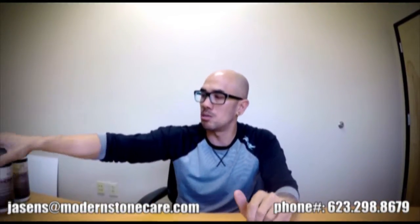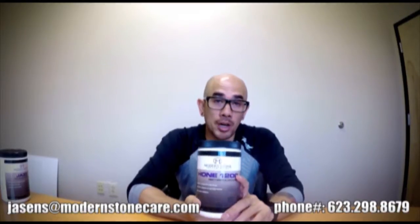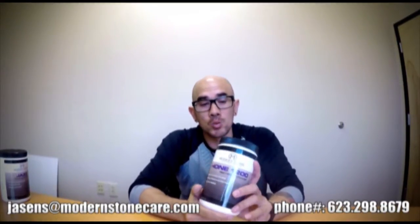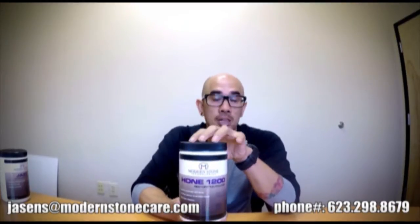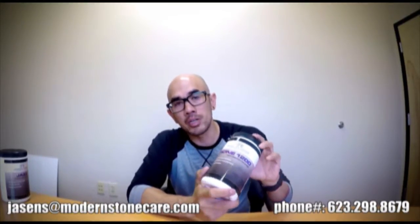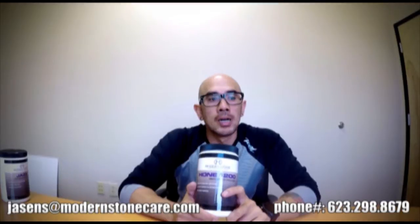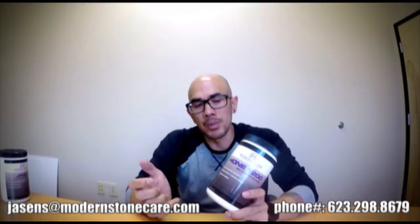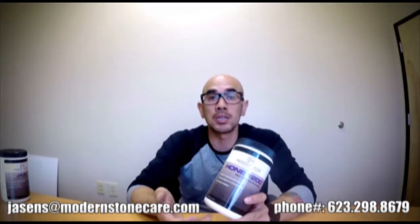The second product I'm going to go over is the Modern Stone Technologies Hone. This product comes in grits of 150, 400, 800, and 1200. Hone powders were actually really big back when I got into this industry in '99, due to some of the challenges I kind of mentioned with the Vortex Diamonds. This was an approach that helped get away from some of those challenges. The honing powder is an aluminum oxide — much softer than a diamond, or even a tin oxide that you might find in some other comparable honing powders or polishing compounds. Being that they're a softer abrasive, they are going to have better results on softer stones like a cantera, an Italian bluestone, or a travertine limestone.